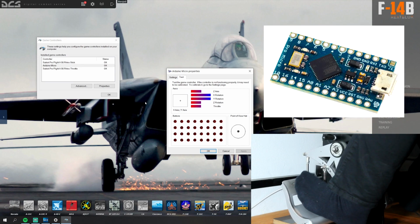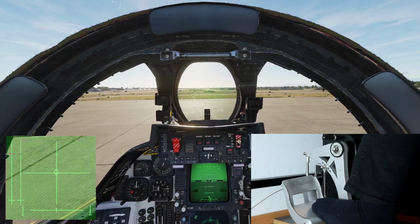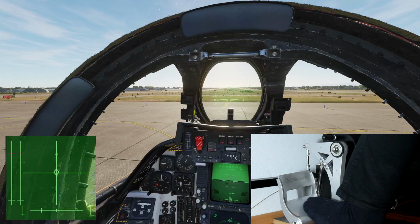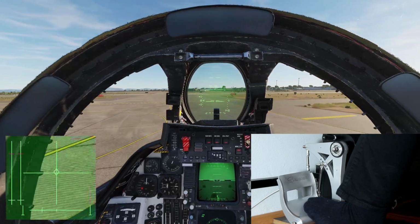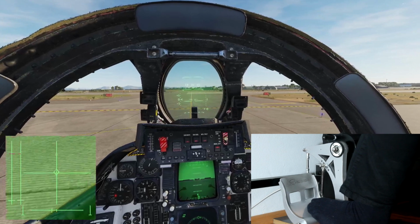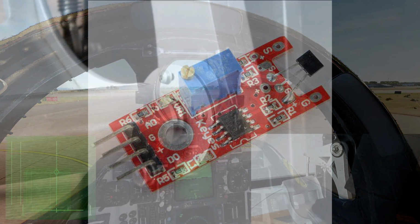Only Arduino Micro and Leonardo can be used for this, as they are the only two which are compatible with the Arduino joystick library. The way these sensors work is by registering a change in the magnetic field around them. I'll leave a link in the description to a website that explains this in more detail. But basically, we just need a north-to-south magnetic field that rotates around the sensor. These are the exact ones I used, but that's only because they were the easiest to get locally.